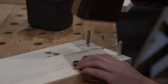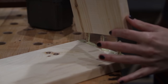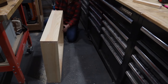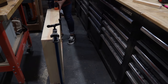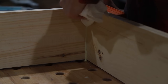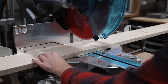Once all the openings were drilled I added the dowels into place, tapped them in firmly, added a whole bunch of wood glue, and then attached the pieces together. Because the dowel joinery was a tight fit, it helped to work on the floor — I assembled everything down there and tapped everything into place lightly using my mallet. Then I added wood clamps, tightened everything down, and allowed the box to dry for a couple of hours. For a quicker option I'd suggest pocket hole joinery or screws with wood glue.